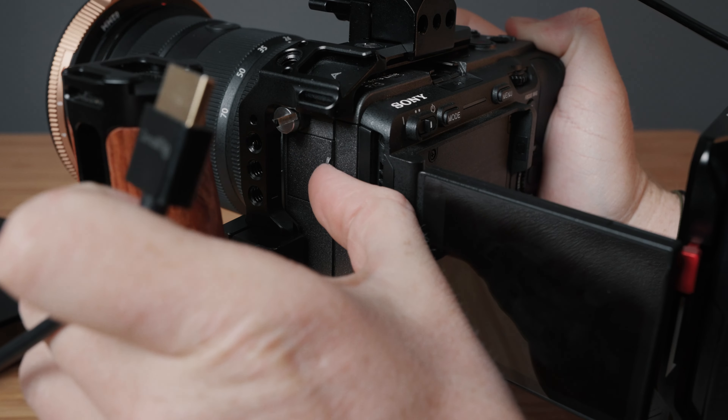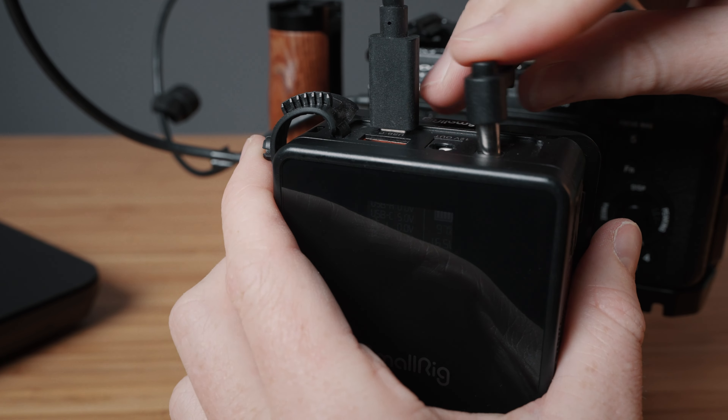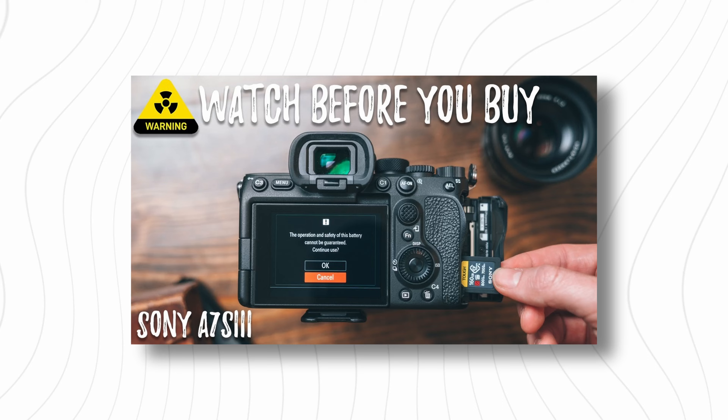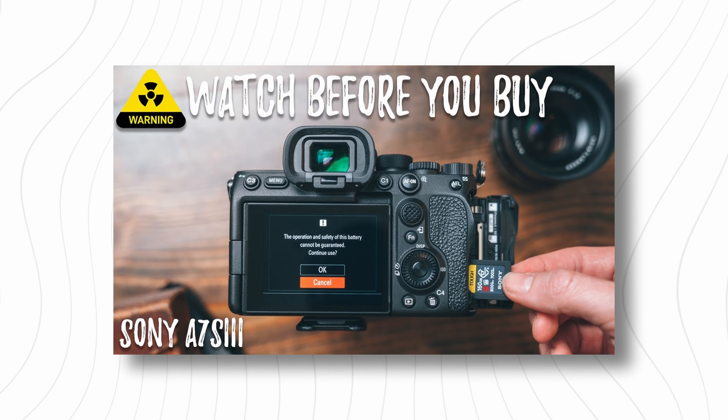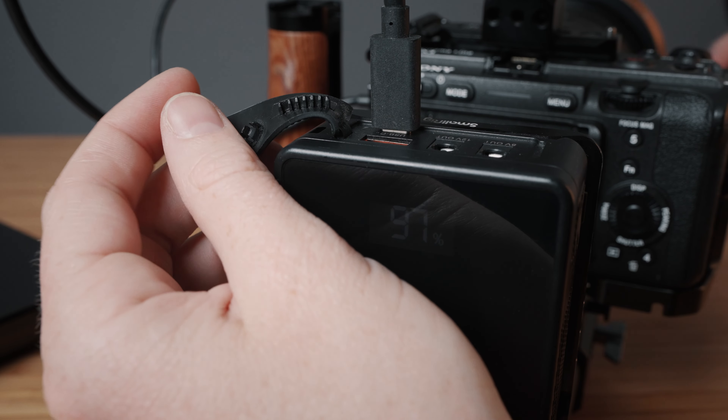Lastly, we have to hook everything together. There's an HDMI going from the monitor, and a dummy battery that goes from the monitor to the 8V on the V-mount. Now, I used to use a dummy battery for the camera as well, but I saw multiple reports on Facebook groups and Reddit that dummy batteries have been frying people's cameras. I personally hadn't had a problem, but I've seen that Sony cameras can act up when not powered by official Sony batteries. So I don't want to take that chance anymore — I just switched over to running via USB-C power delivery instead.